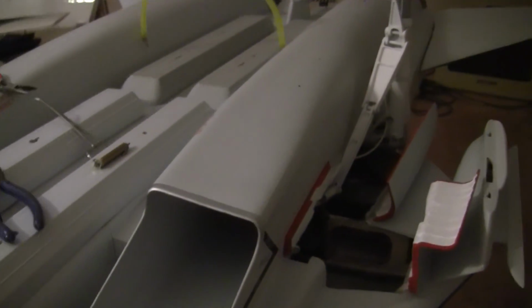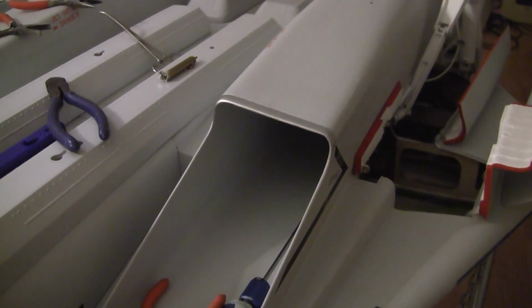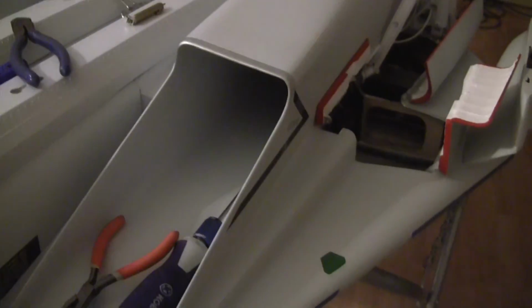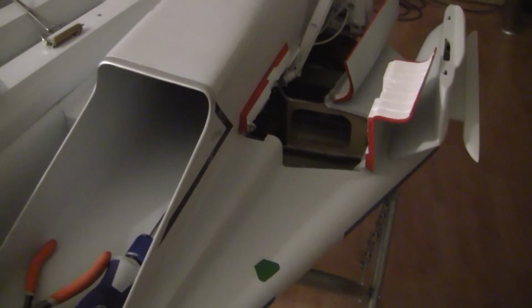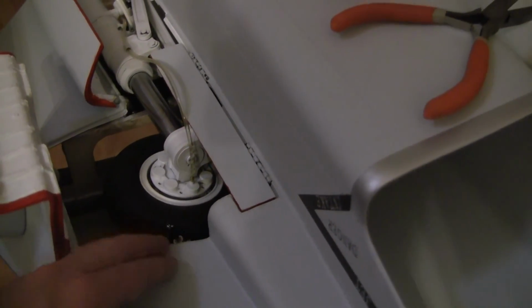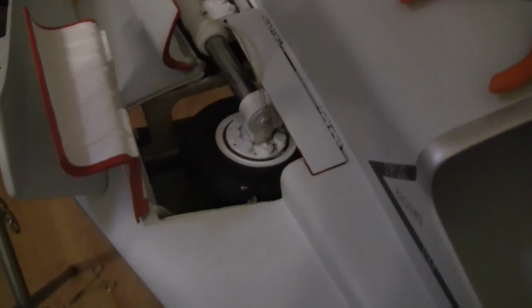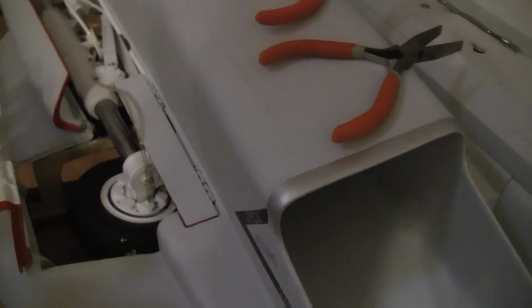So I figured that out, got the gear working, holding air pressure. It works great. But then I had a problem with the gear doors. The gear doors were leaking like freaking water spouts. Some of them would leak around the fittings, and I'd go back and put some Hysol on the fittings. Others would leak internally. The O-ring would get blow-by, so it would be hissing out your Jetronic valve, and I just got fed up.